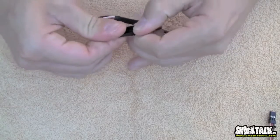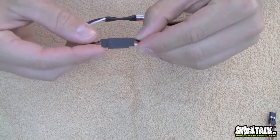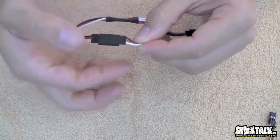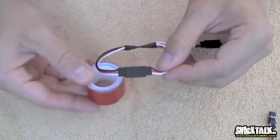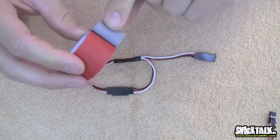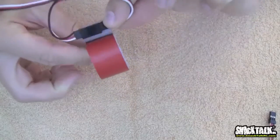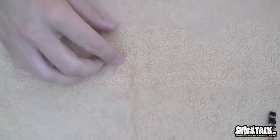So what I do is, you can buy a yellow clip made by, what's it called, HI Model Products or something. Tower Hobby sells them, I know. It's a yellow clip that fits on it. There's other clips where you can swoop them through the wires. But if you're cheap like we are and just want to use something at the field, just use this 3M exterior tape. It works great. Cut off a little piece and just stick it here, and then when you try to pull it apart, it won't pull apart. So this is the servo connector, a great all-around sort of connector.